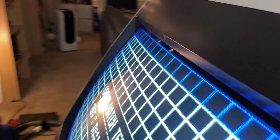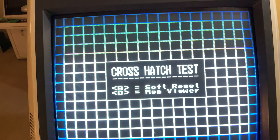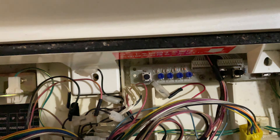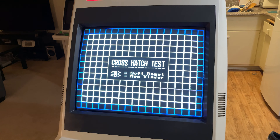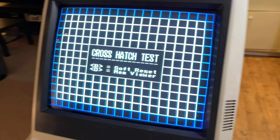It just wouldn't fit through that door. Another thing that helped a lot: these pots on the side — you can see right there, there's four of them. Those are the contrast and the RGB bias. The contrast was really, really high, so it kind of washed things out and made things bleed. So I turned the contrast down a lot, as well as the contrast knob down there — the black one on the left. And it gives me really, really sharp pixels. I don't want to have this thing at max brightness; it burns the tube out and hurts my eyes. Win-win situation for turning contrast down.